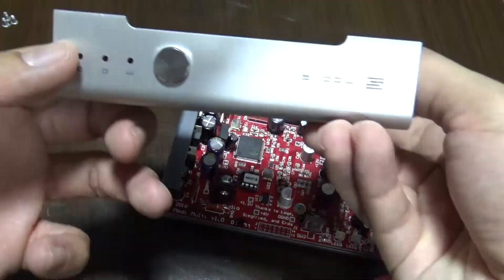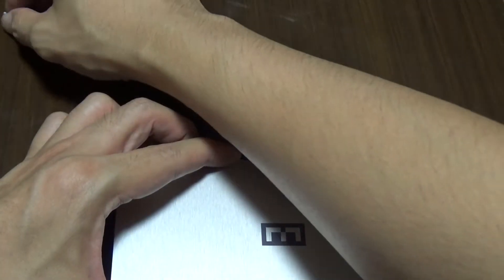Finally, you just need to slide the case back in — this is actually the most difficult part for me, but again just have patience and take your time. Put the button back in the case, make sure you line up the LEDs in the hole, and check if it will slide in. Mine was a little bit bent so it took me longer, but you'll get it. Put the screws back in and you're done.